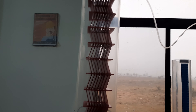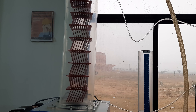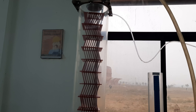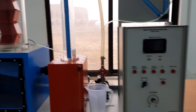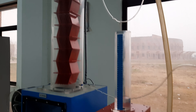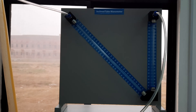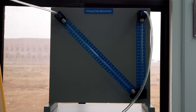Measurements of temperature and relative humidity of the air at the inlet and outlet of the packing allow the change in moisture content of the air to be determined and the mass transfer to be analyzed. A pressure difference is created inside the tower during operation. To measure this, an inclined tube manometer has been installed which measures the differential pressure across the tower.